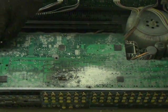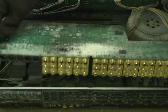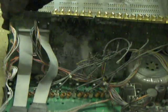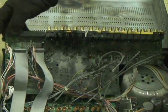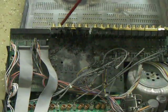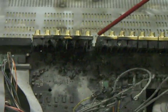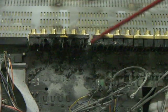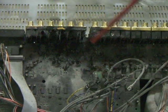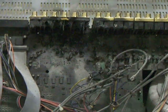Removing this circuit card to get underneath. These banks of plastic connectors are manufactured from flammable material which will burn and continue to burn after it ignites. You can see the fire damage going down on the circuit card.